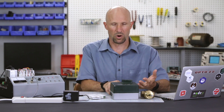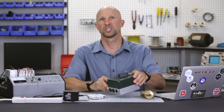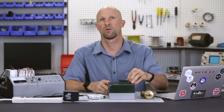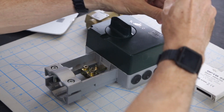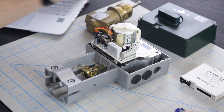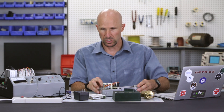When it comes to wiring, check your actuator manual for the wiring and power requirements. This SQS 61 actuator is powered by 24 volts AC and takes a 0 to 10 volt DC control voltage. To power the valve I'm going to use this small AC transformer. Now let's wire it into the actuator terminals. I'll begin by removing the cover off the actuator, which gives me access to the screw terminal. I can see where the AC needs to be wired into the G and G0 terminals.